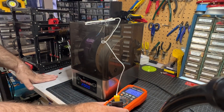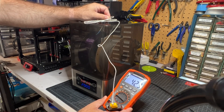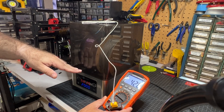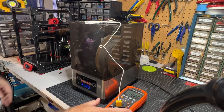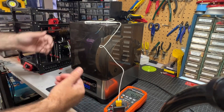The reality is I think you're still going to get a pretty good dry on your filament, but it's definitely shy of 70 degrees at the top. So that 70 degrees — or 68 degrees in this case — is only going to be at the bottom. That's something to keep in mind. Now, if you're printing and you're moving the filament around, you're going to get a more even dry. But if you're just going to leave it sit, you might want to come in here and occasionally move it.